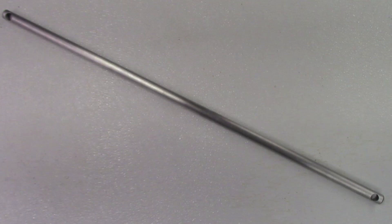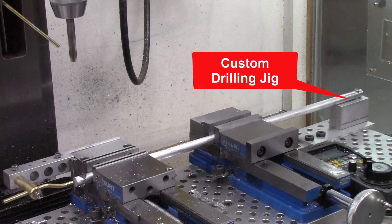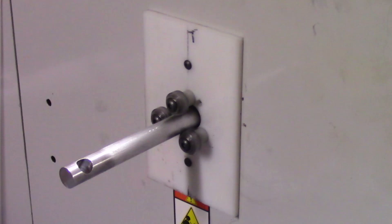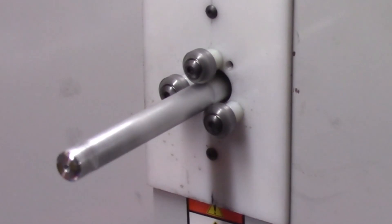This concludes the video in which we demonstrated modifications of both our CNC mill and the Tormac 8L lathe to enable the machining of long rear support bars for the AccuSlice Index Table. The custom drilling jig enabled the drilling of both ends of the 26.5 inch long bars, with the two holes precisely drilled 25.5 inches apart and perfectly aligned and parallel — permitting the machining of materials much longer than the normal 20 inch X travel distance on the mill. The assembly with three roller bearings mounted on the outside of the Tormac 8L lathe case eliminates the whipping action when turning long bars at high speed, allowing machining of both ends of the 26.5 inch bars with no whipping and no excessive vibration, even at 2500 RPM.